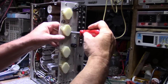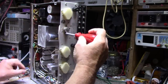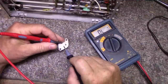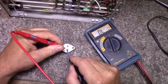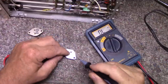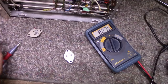We've got RCA devices. Yeah, that's shorted for sure — and so is that one. That's a hard short right there. Okay, this transistor is done. Let's take the other one out and try it — that one should be okay. No hard short collector to emitter. This one's bad too.